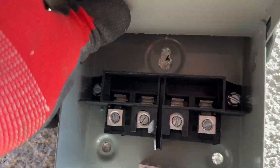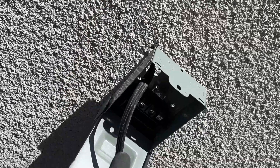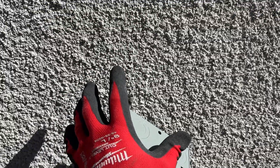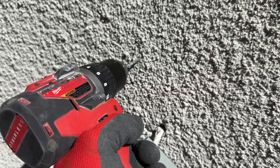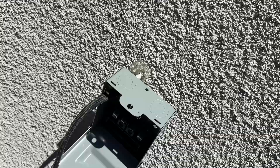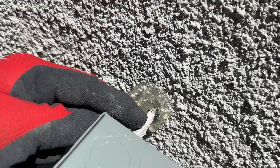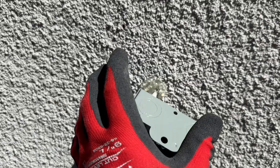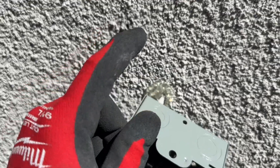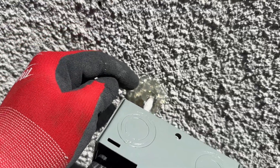It is a little more expensive, but I use it on special occasions for things I really want to hold up to the weather out here. So I got my knockout there, wire pulled through. I'm going to make a little mark right there, then come back and drill this hole first through the stucco — I want to make sure that's clean. Then we'll put the caulking around here, press it up against the wall, secure it, and we can strip these wires and get them connected. Now I have this hole pre-drilled, and you can see I got a good layer of that caulking all the way around the inside of the wire. I built it up a good amount so that when this goes against the rough stucco, it'll seal around the outside of this knockout. At the very end we'll seal around the box too — just to make sure no moisture or water is getting inside that wall.